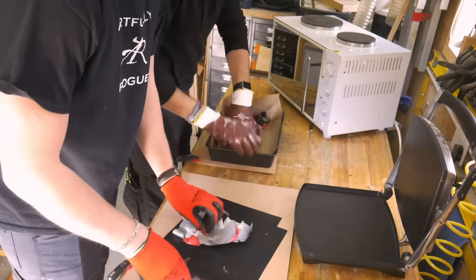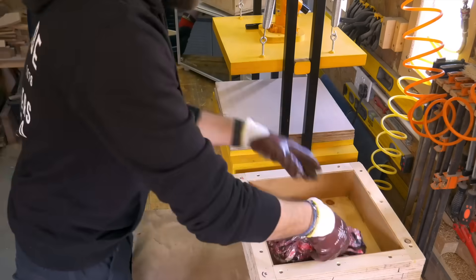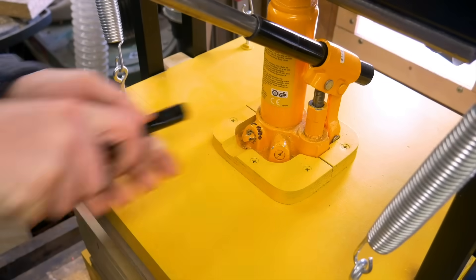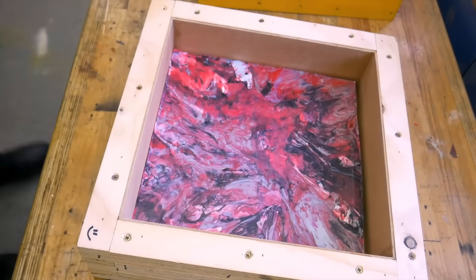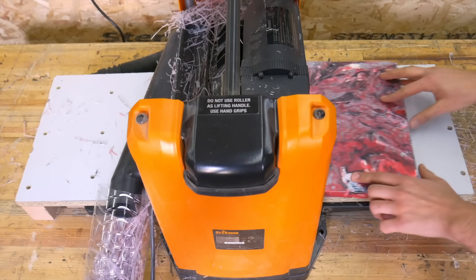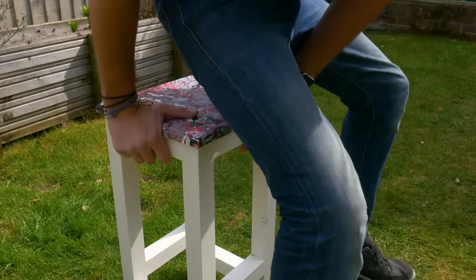The press can melt the plastic really quickly and you can chuck that into a bigger tray in the oven which will maintain the temperature. The bottle jack press is perfect for this type of project as it can get lots of force down really quickly and really evenly. This sheet was around 12mm thick and about 300mm square. We used our thicknesser to tidy up the surface and then eventually this became a stool top.